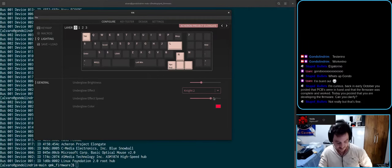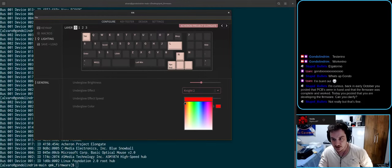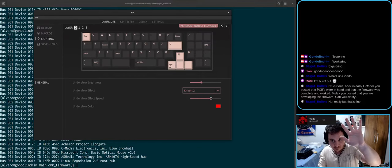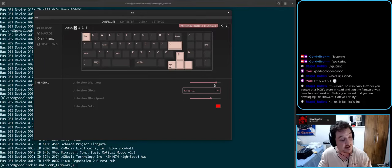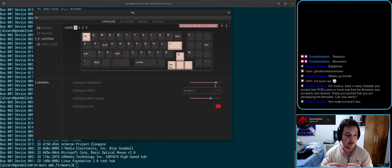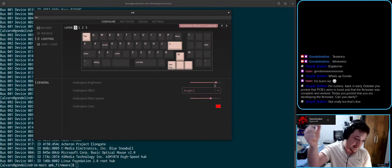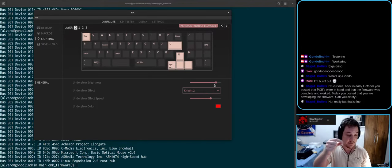But the thing is, we had to redesign. So it went for redesigning, and we did a fourth version. Now, the fourth version was USB-C, used an ARM processor, and it worked. The problem was the USB connector. We had an issue where the Elongate case was designed for a mini USB connector. When we used the USB-C, the connector that we used did not protrude enough so that you could connect the USB connector from outside. It banged against the case walls because the connector was so short.